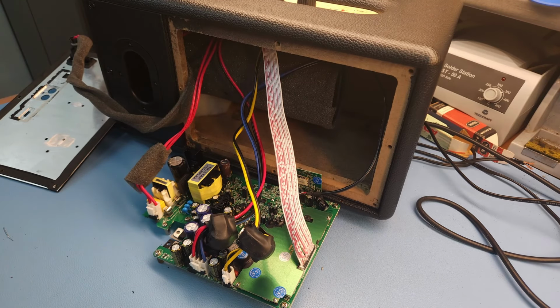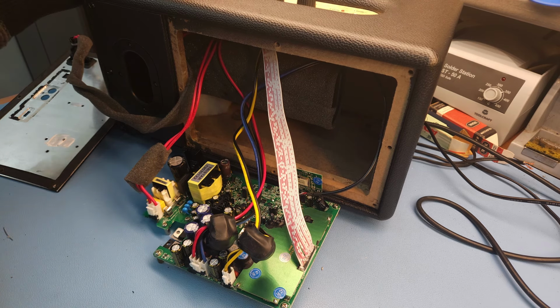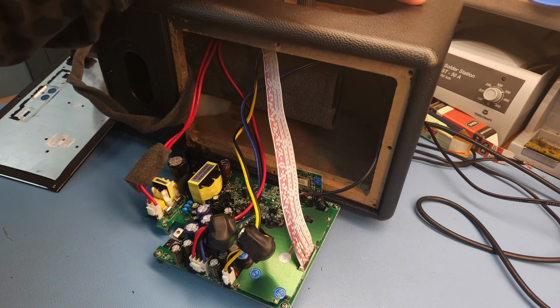That is fine. I'm just going to give it one more bulb on the dim bulb limiter to get it up to more than 200 volt. So this is 238 now, and the Bluetooth LED is flashing. At the moment it seems to work.